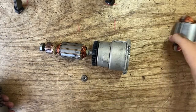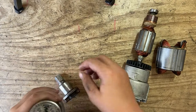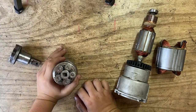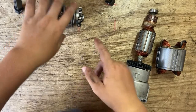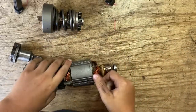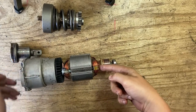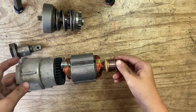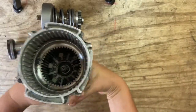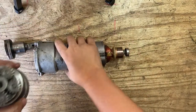So this is what's inside of the impact wrench. This is a stator and this is a rotor, and this is what holds all the gears in place. These gears go into the sockets, the stator goes in here, and there are brushes with wires that go to the commutator, which starts the electricity to flow to the rotor and makes the rotor spin. The rotor spins on that metal pole, and then these gears connect to that metal pole.